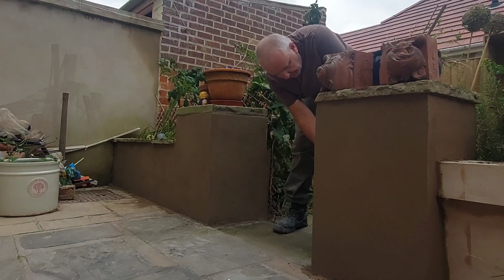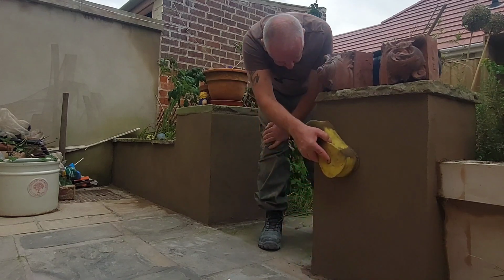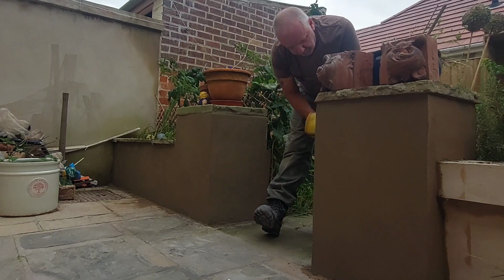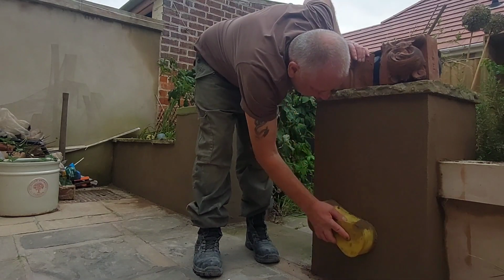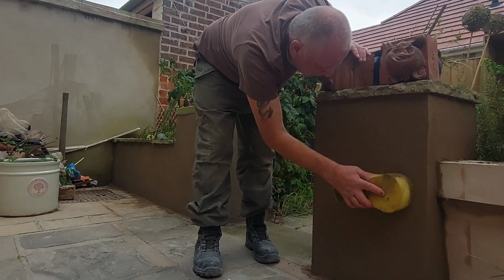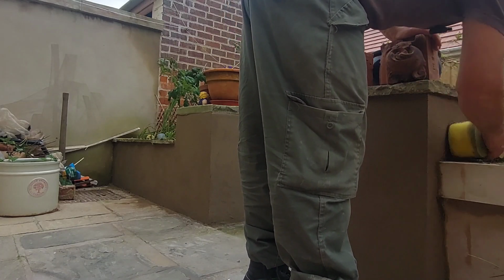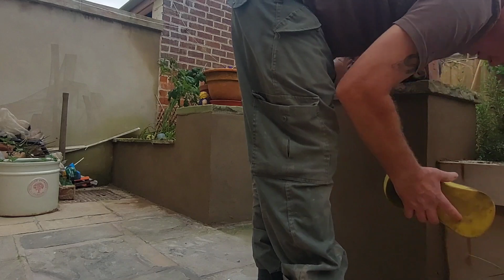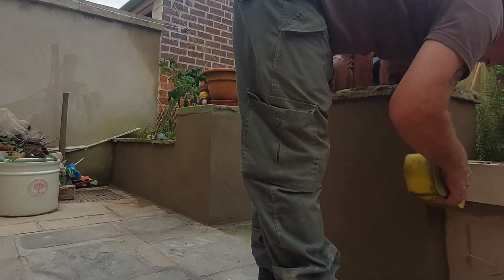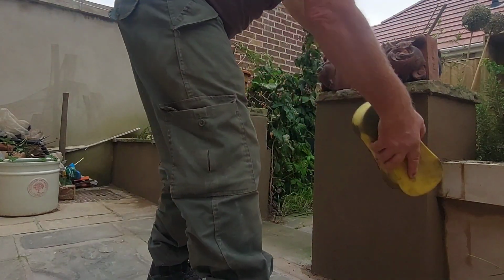Right, so that's basically the step-by-step guide for cement render. Nothing hard about it. You know, if you can handle a trowel for putting on plaster, I'm sure you can get sand cement render on. I know a lot of the younger generation that are out now that are excellent at skimming and dabbing and things, but they're absolutely useless when it comes to rendering. And it's purely because they're not taught when they're serving their time, which is a shame. And a lot, of course, don't bother with it because they're either doing the spray renders or they're doing the K-rend. There's quite an art to working with a cement mortar. You know, once you've got used to using it, you know what it wants, when it wants it, etc., and how to form your shapes. You know, it's not that hard.